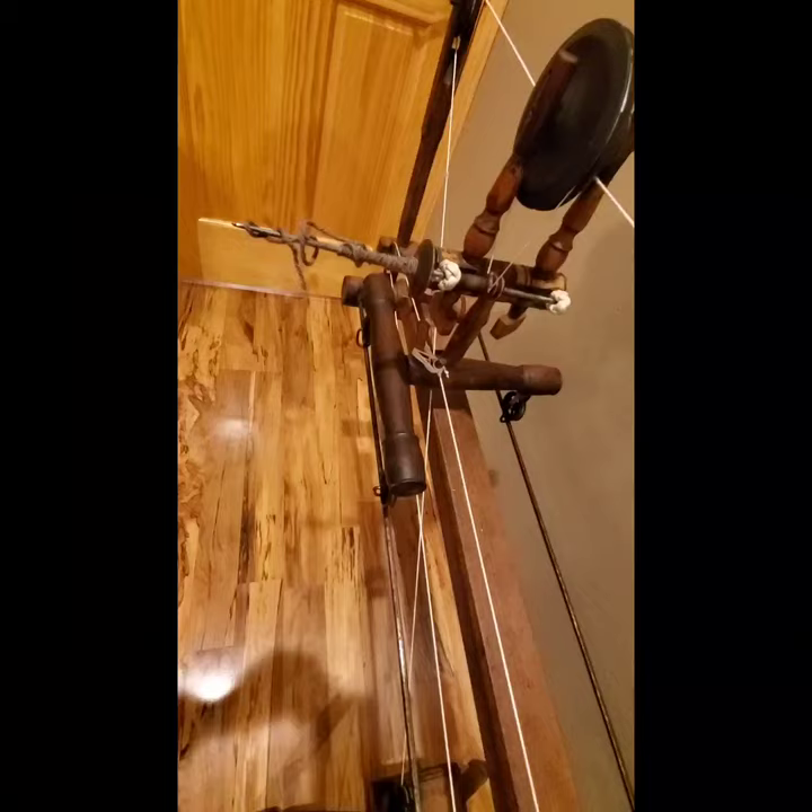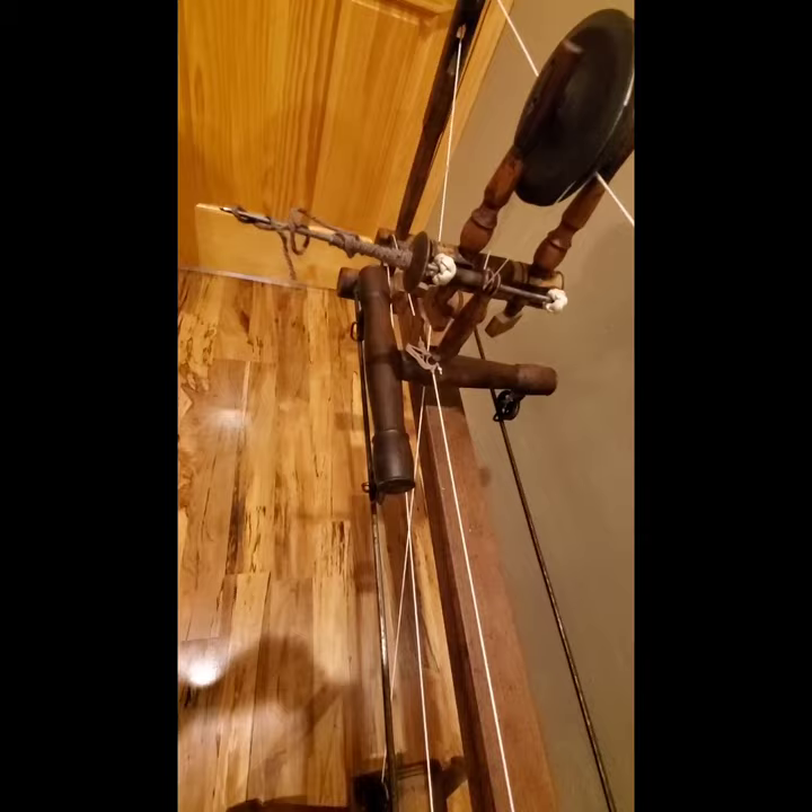The other band is hooked to the front and the back of the carriage. You can see the line moving forward to another idler pulley, down and around to a larger pulley where it needs to be wrapped four or five times. Then it comes on around to another idler, and then back to the carriage — and that's what moves the carriage back and forth.